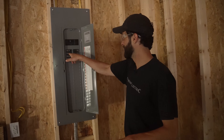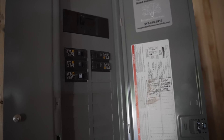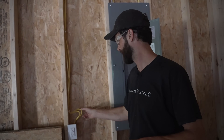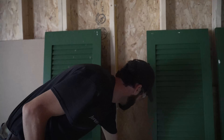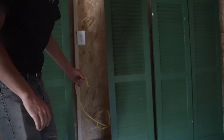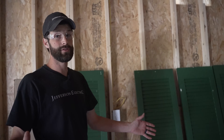The overview is this: circuit breaker number three is a 20 amp single pole. From here, the home run exits the top of the panel and jumps over right to the left at this GFCI. From that point, everything downstream is GFCI protected because we're connected to the load side. So the load side wire pops out, comes down and hits this receptacle here. From there, we've got a whip coiled — it's all ready for us. I'm going to cut that into the exterior siding, install and terminate. I'll show you a few tips you may not know that most electricians across the United States omit.